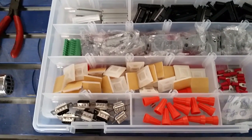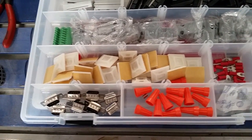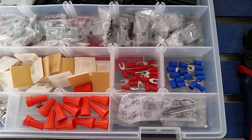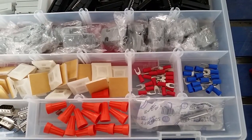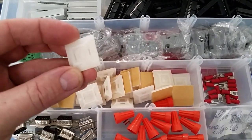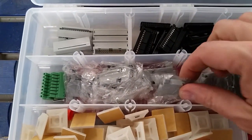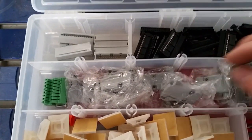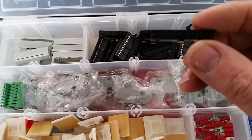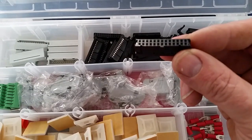And some of the wire management that I have. I got some DB9 female or soldered female and male connectors, wire nuts for temporary type stuff, just for testing. And then there's your Home Depot spades for power supplies. These, love these too, except I would recommend going through the center with the screw. That tape doesn't last too long. And then here's the housing for the DB9, and then some DB25 connectors, ribbon connectors. This is popular on the Smooth Stepper.